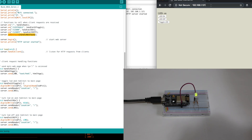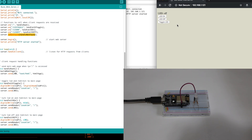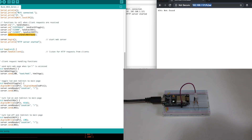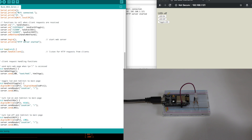I can go directly to the LED toggle path — it's a valid path and the LED should go off. Then the web page refreshes and we see the status is now off. If I go to something that doesn't exist, we get the 404 error and have to manually go back to the main page. Now the server is running and listening for requests. In the main loop, all we do is let the server handle client requests — the whole sketch is just sitting and listening for HTTP requests from clients.